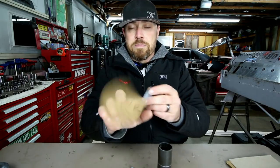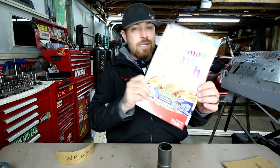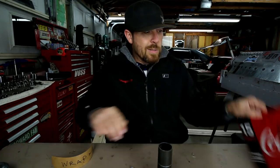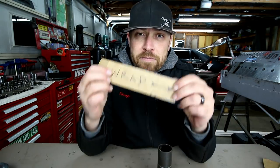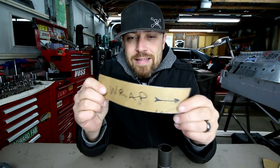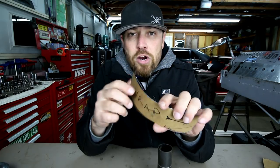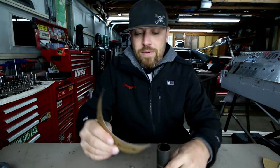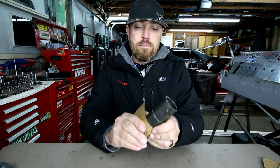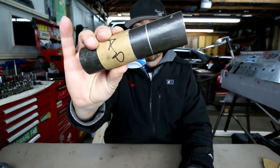This thing was made out of a Natural Light case. What I like to do is keep cereal box fronts and backs, or beer cases, whatever — keep that stuff for templates in the shop. You might be able to go buy these, but they're so easy to make. Make sure you have straight edges on both sides, or at least one straight side that's clearly marked. Make it about an inch and a half to two inches wide, and as you wrap it around the tube it will ensure that the line is true all the way around.